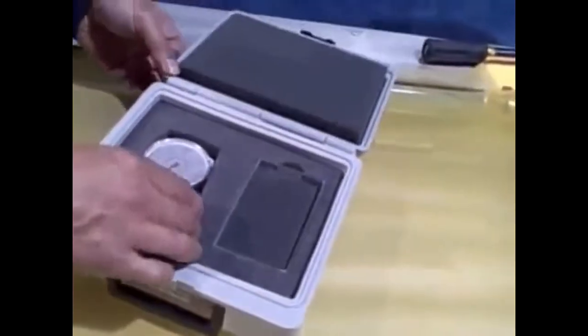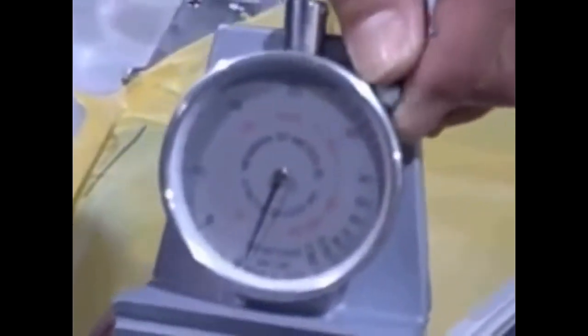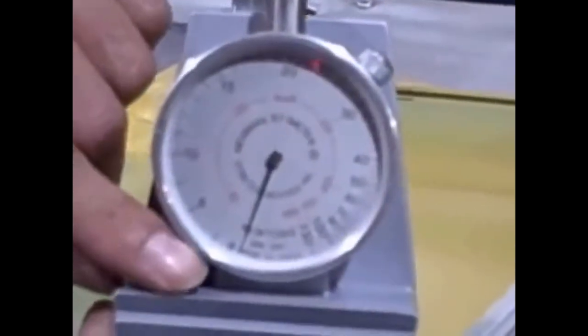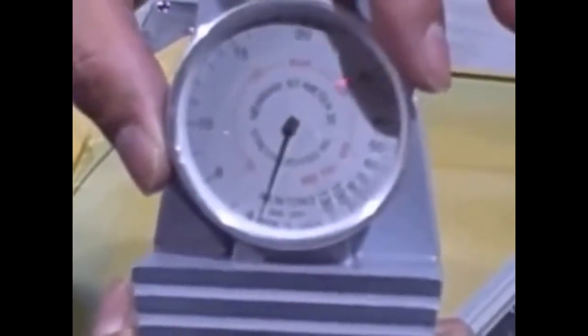The way you check if it needs calibration — if you look at the meter, there's a little set screw up here towards the top right. What you want to do is loosen it, and that allows you to move the face. You're looking at the needle and this little circle with a line through it — that's where zero tension would be.